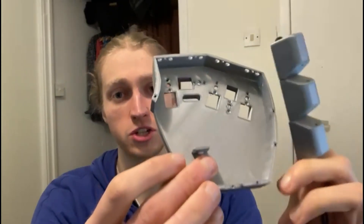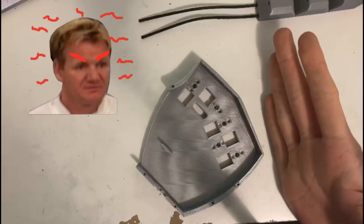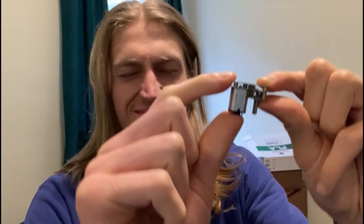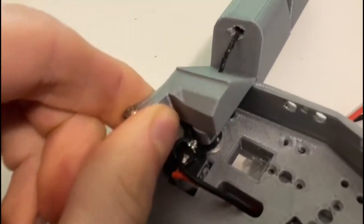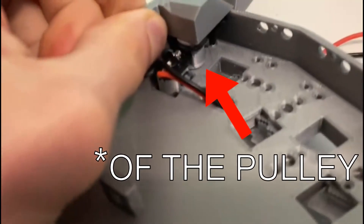So we've got a new prototype that we can track our finger into, and I've forgotten about the elastic follow-through holes. We've also got some new motors, but they're not quite the right shape at the moment. I've fully printed this so we can actually see what's going on internally with finger movement. The spinning motor drags the pulley, which then drags the finger. Although this time we're getting way more consistent movement because the design is way better, if I do say so myself.